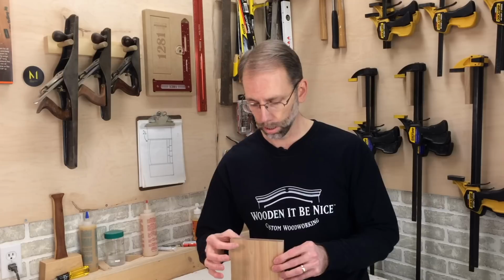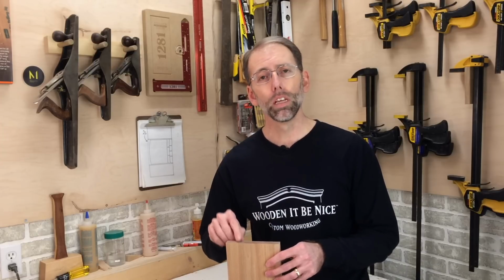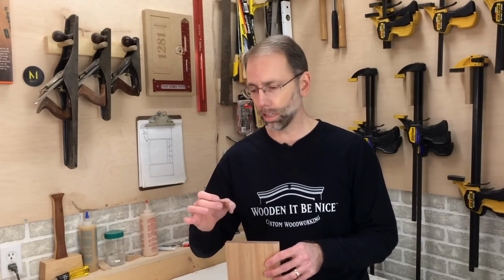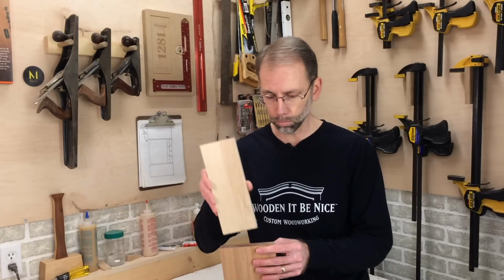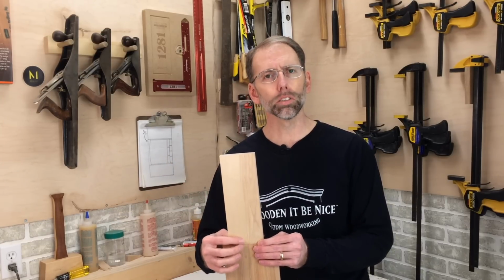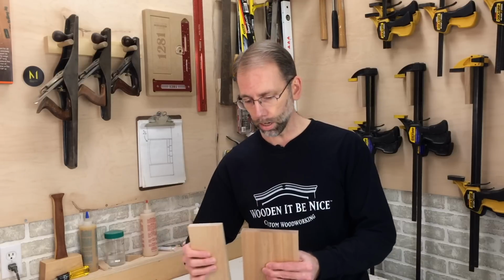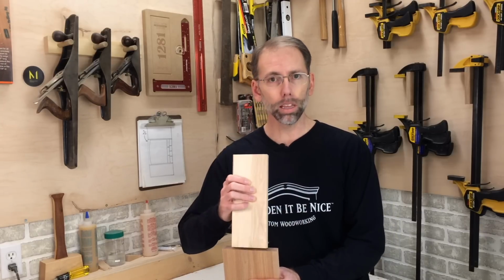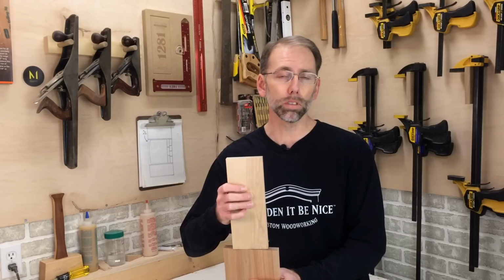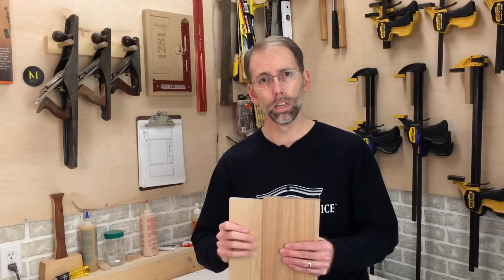Before you repair wood, I want you to understand the grain pattern in wood because it's really important. Grain typically runs the length of boards, and at the end you've got something called end grain. If you were to look at this under a microscope, it would be like looking at the ends of straws. There is very little structure on that end, and if I were to try to connect two pieces of wood this way, there would be very little strength because it would be like trying to glue a bunch of straws to the end of a bunch of straws. Now, if I connect the grain like this, I would have a very strong bond. So if you've got a break this way, the only way that you can fix it is reinforcing that joint. Typically, this is very difficult to repair. If you've got a break this way on the grain, you can fix that.